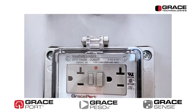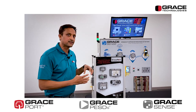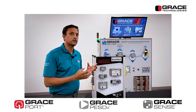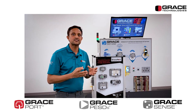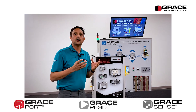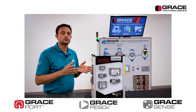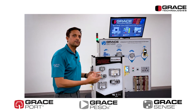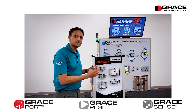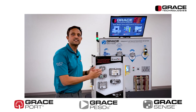One more important topic is the GFCI, which is a ground fault circuit interruptor. This is very important with industrial control panels — it is not a nice-to-have feature anymore; it is a must-have. If you look at NFPA 79, the standard for industrial machinery, and also UL 508A for industrial control panels, they state very clearly that any type of receptacle mounted outside the enclosure or control panel must be GFCI protected.